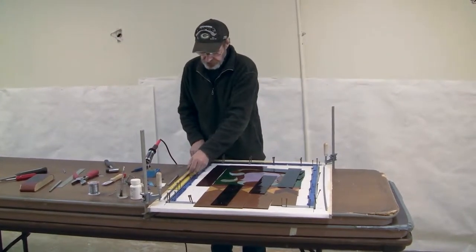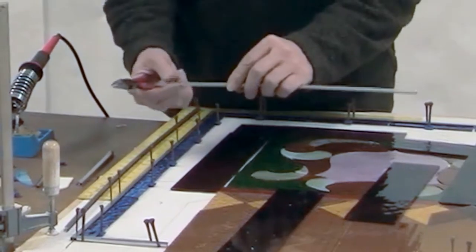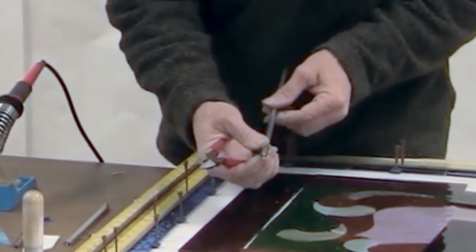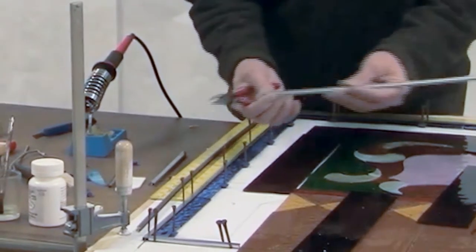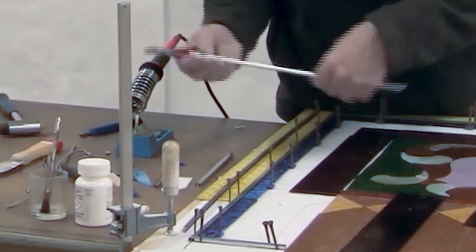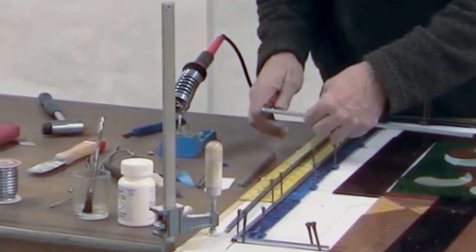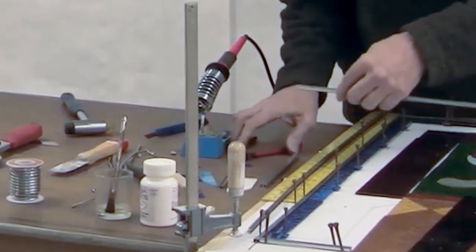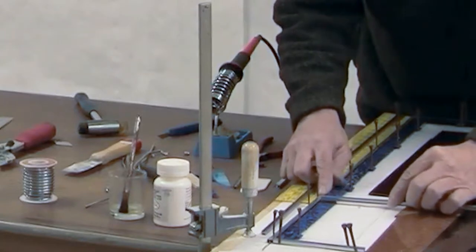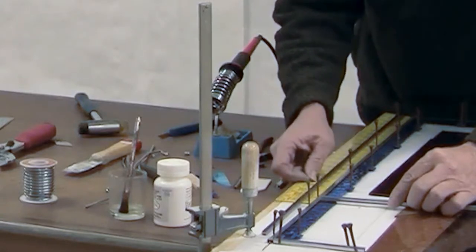Before we can put them in place, though, we need to cut our connections in between each piece here. The way that you cut with the lead dykes is that it will put kind of a tapered end on the ends of the lead where you cut, and you got to cut that off. So you just basically eye that straight, snip that off to become square again. You want it square as far as top to bottom and left to right, because it's got to fit up to the zinc, which will be replaced, to the lead, and also into the lead seam, that first seam here.